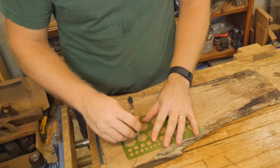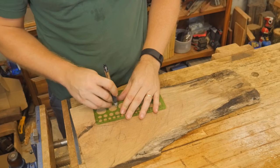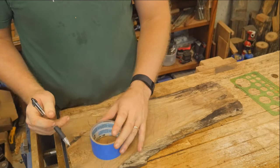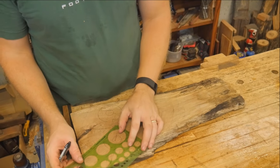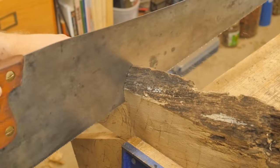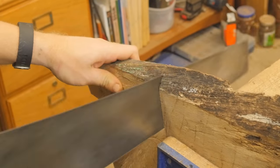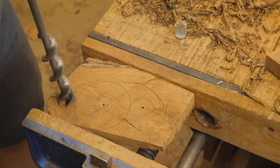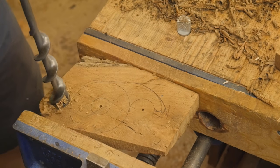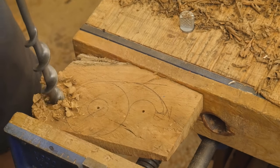I need to make two nuts for the front of this vise, and I had this hunk of white oak that wasn't good for much else and it works perfectly for these. I used a combination of stencils and tape rolls to mark out and play with the design - basically making an S shape with the S in the middle. I can cut them to a rough dimension so that I can work with a smaller piece, which makes it a little bit easier to clamp. Before going any further I use the brace and bit to clear out the holes on either end so I don't have to sculpt those with a turning saw.